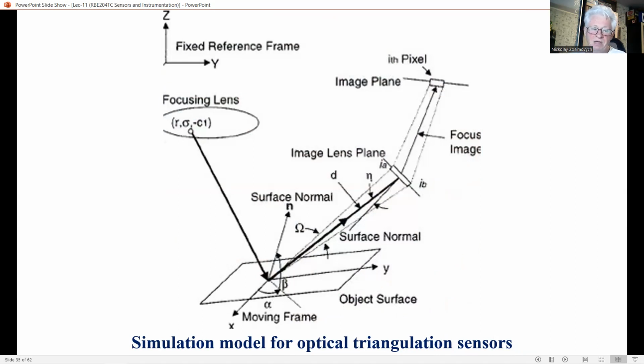The sensing system consists of a ring with a large number of transmitters and receivers located alternately around the ring and pointed inward. The area inside the ring is scanned by successively activating the transmitters. The light from each transmitter is detected by all receivers simultaneously. When an object resides in the ring, some of the receivers are in the shadow of the object and will not receive light while the others do.